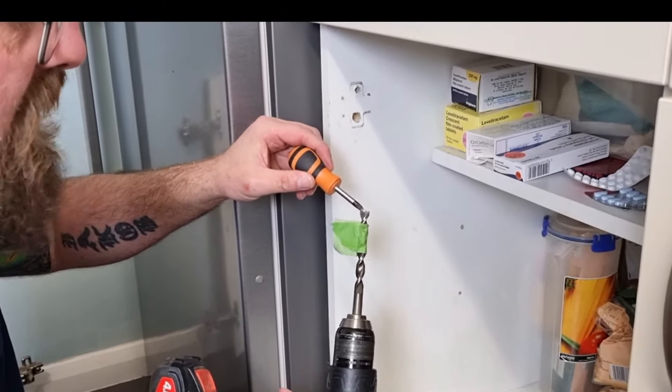I've now got the 3mm drill bit in and I'm going to pilot hole directly into the center of the dowel. The screws we're going to be using are PZ2 type, 3.5 millimeters in thickness and 16 millimeters in length. If you've got a second person to help you, this would be handy at this stage. Start off by putting the top two screws in first, and just nip them up — don't over-tighten.